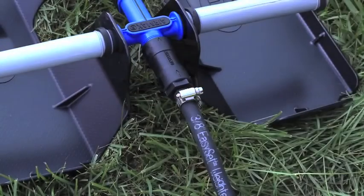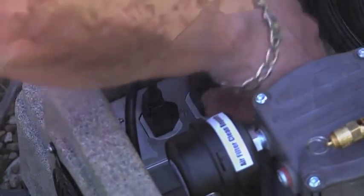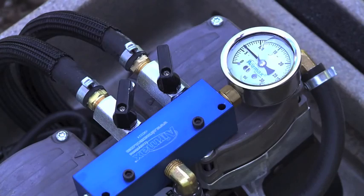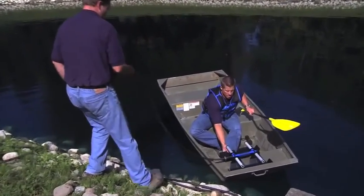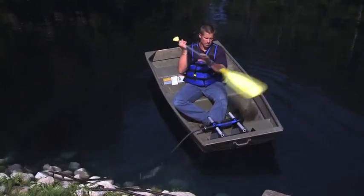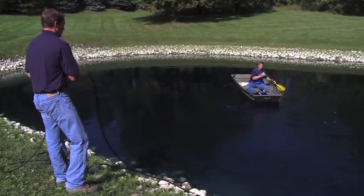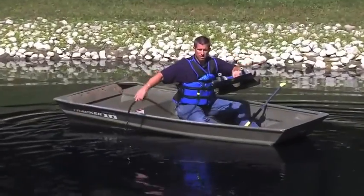After the airlines are connected and the diffusers are assembled, it is time to prepare your system for startup. Plug your compressor and cooling fan into the power outlet inside of the cabinet, then connect the power cord coming from the cabinet to the standard ground fault circuit interrupter, also known as a GFCI outlet. The system should now be running. The next step is to install the diffusers. The first option is to use a boat or raft — one person sits in the boat and the second person hands them one diffuser with the connected easy set airline. As you begin to row out to the diffuser placement area, the person on shore guides the airline. Avoid any twists in the airline, as this may cause the diffuser to move away from the intended area when released. When you have reached the placement area, simply release the diffuser into the water. The diffuser is weighted and will require no additional weights to sink. With the system running, you can easily watch to see if the diffuser shifts when it is underwater.